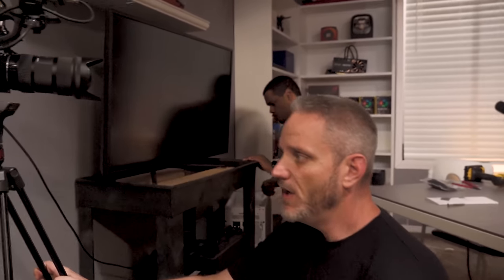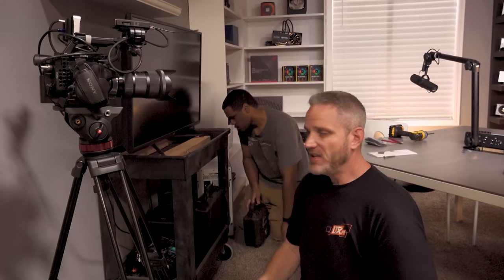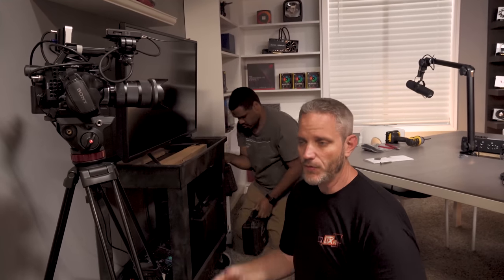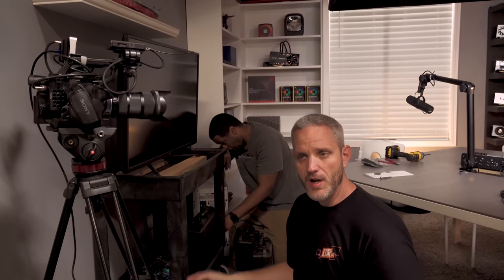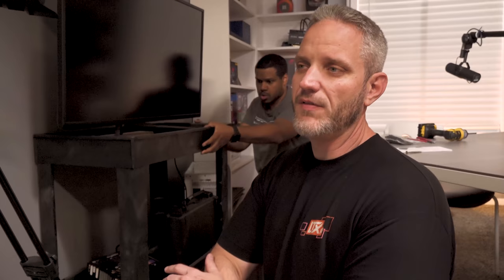But in terms of the live stream, we don't want to desync our video and our sound, which can happen if I go mixer to computer and video to computer. They can become out of sync, and it's happened before. So if we go mixer to camera, let that be audio source to camera, and then camera through DisplayPort to the computer, those stay in sync. So that's gonna be our connection here, with wires everywhere that we'll try and make as neat as possible. Right now we need to get everything set up and tested. Once everything works, then we can worry about cable management so that it looks nice, but is also easy to service if we have to change a cable.